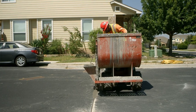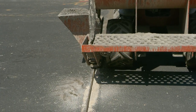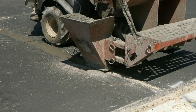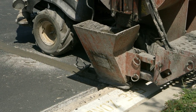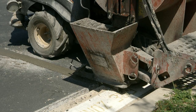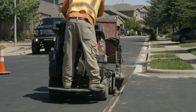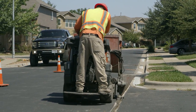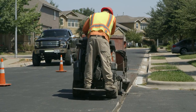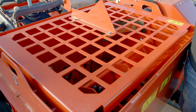To release concrete or grout into trench, lower hopper into the trench to desired depth. Turn the vibrator motor on and continue to run the mixing blades. Open the tub door until the required flow to fill trench is reached. Move machine forward while discharging material into the trench. Time ground drive speed with material flow to fill the trench to desired depth. Close the tub door and turn off the vibrator when finished.